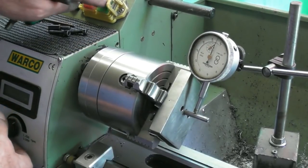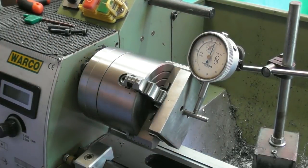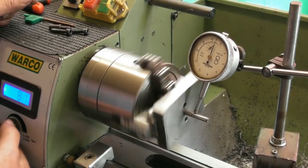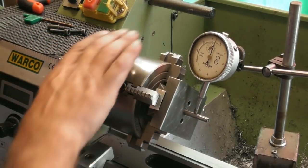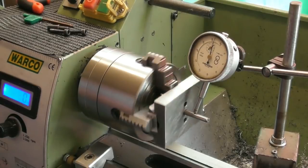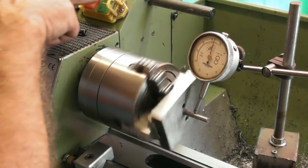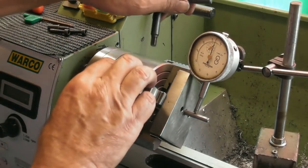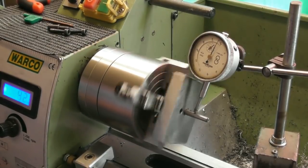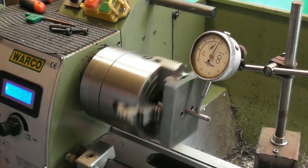I think a lot of that is my hand influencing the... I haven't plugged the lathe back in. I unplugged the lathe to plug the drill in. So, okay, we do a little bit of sound. And it's there. Couple of tenths there, I reckon. I'll see if I can get him a bit better. That's the very spot. Yeah, you're talking around half a thou there. So happy days. Pop that dowel back out and let's go setting up a boring bar on centre somehow.